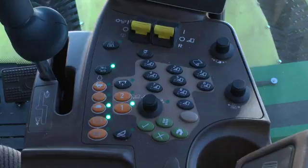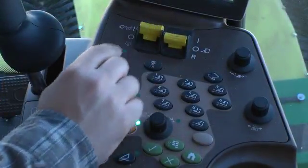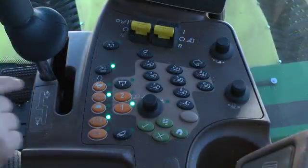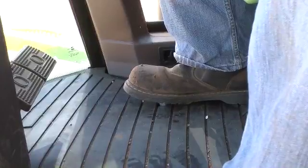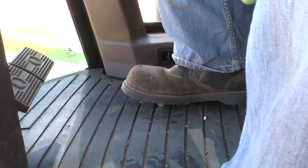Operate the engine at low idle for 2-4 minutes to gradually approach operating temperature. To further warm up the engine and hydraulics, engage the fan and cleaner and header. Speed the engine up to high idle and depress the floor switch to operate the cotton handling system and RMB for approximately 5 minutes.